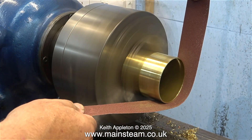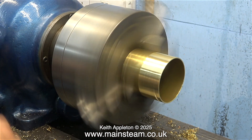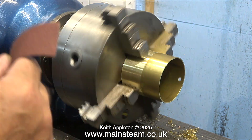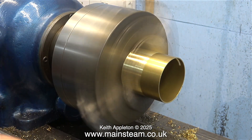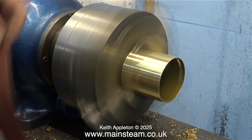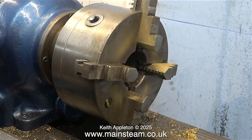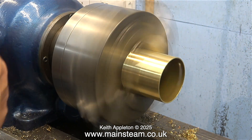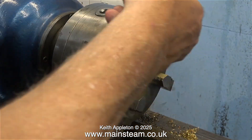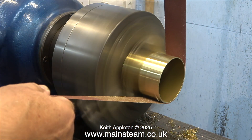Here I'm cleaning up one of the tubes — quite simple: mount it in the four-jaw self-centering chuck, spin it quite fast, and use a piece of emery cloth to score the surface, making sure that you always pull the emery cloth in an upward direction. That way, if anything goes wrong you fall away from the work and not into the chuck. Always be careful and have a healthy respect for machine tools — they really can do a lot of damage. Even very small machine tools can bite. Always keep your concentration level high; if you start to get bored it's time to stop, do something else, and come back to it.